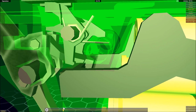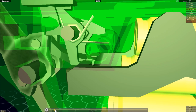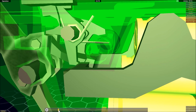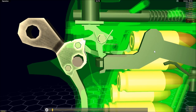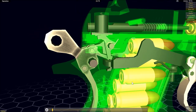As this piece travels backwards, it causes the hammer to pivot down and back, cocking it. Once the trigger bar and the piece attached to the hammer break apart — because the sear is already holding the hammer back — the trigger bar trips the sear, just like in single action mode. This piece and its interaction with the trigger bar is how we get that double action functionality: one action cocking the hammer, and the other action tripping the sear.